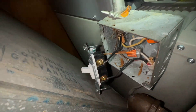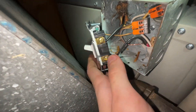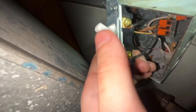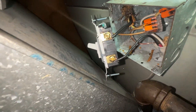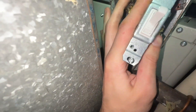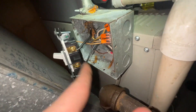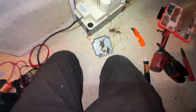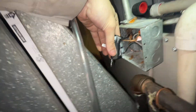I'll electric tape them and also reconnect the ground up to this ground terminal and Wago that in with the other grounds. I've got my three grounds - one of them comes up to this grounding screw right here. I hooked my blacks and screwed those down nice and tight, making sure the hook is in the direction that you're tightening. Also making note that this is in the up position when it's on. Now I'll tape this up with electric tape and get the cover back on after I remove this broken switch. Got that all taped up with a few layers.